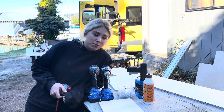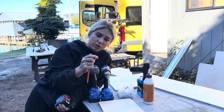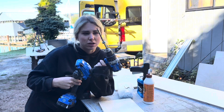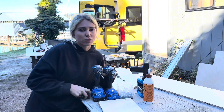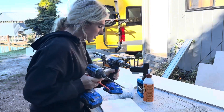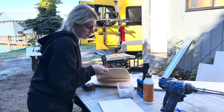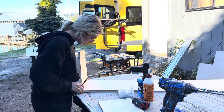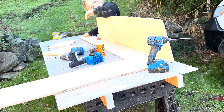Building cabinets in the van is actually pretty easy. All you need is a pocket hole jig, pocket hole screws, an impact driver with the bit on it, a drill with the Kreg micro jig, and of course a tape measure and pencil. The hard part is conceptualizing. I'm a very visual learner, so I'm going to start assembling these cabinets even though they're nowhere near done, just to help me figure out what missing pieces I need.